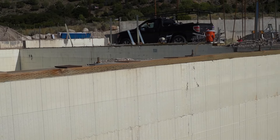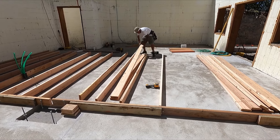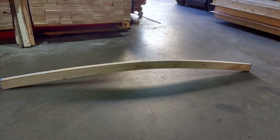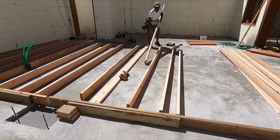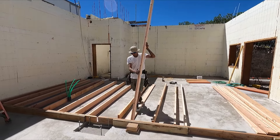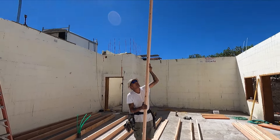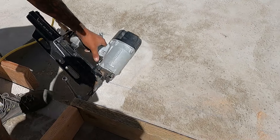What Joe's doing here is crowning the studs — that's the banana shape. Here's a really exaggerated shape. You've got to get those all pointing in the same direction so you don't have waves in your wall. We stand the stud up and rub it against a string from plate to plate, leave a little mark, and you know the exact height to cut.